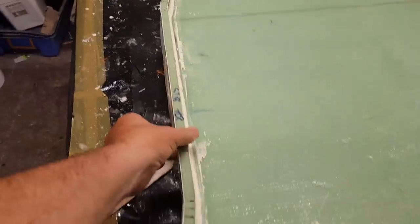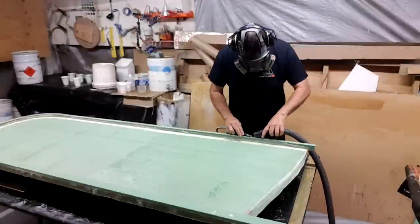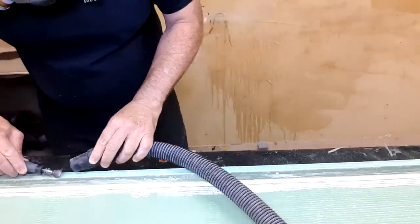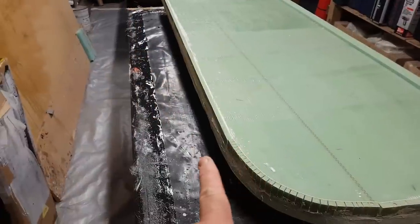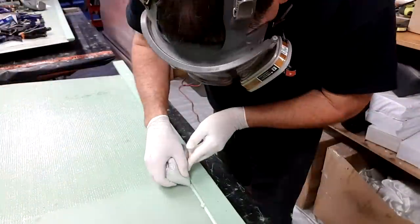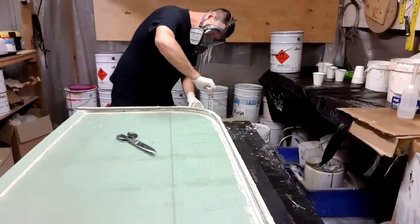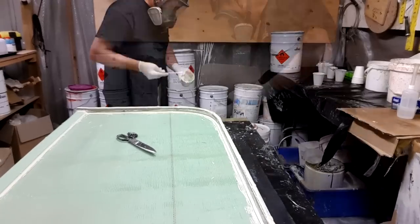You can see how rigid this is now - this is why I've gone with the already pre-laminated glass, it's going to save me a lot of work in the long run. I need to core the foam in the top so that I can get some of this bedding compound to roll over the top, then we'll be able to glass it and complete the surface all the way around as one piece. The coring of these additions is required to provide a solid edge, to seal the foam and laminate edges together, and it provides impact protection and rigidity.